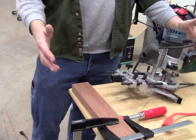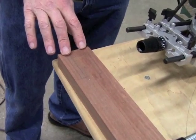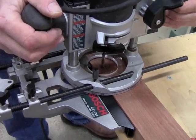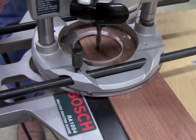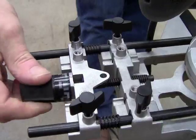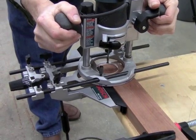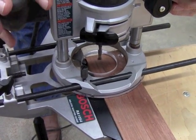I'm set up here to route some mortises. Now you'll see a lot of intricate jigs for doing this, but you really don't need them. If you have two pieces, you can clamp them together, and the second piece will stabilize the router for the cut. One of the nice things about setting up for a plunge router is you can just gently set the cutter on the surface, then make your fence adjustments. I also like to route to the full depth at each end of the mortise, so I don't need stops to set the length of it.